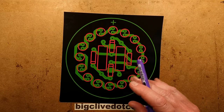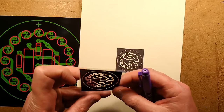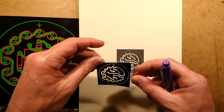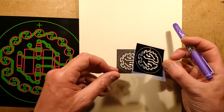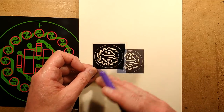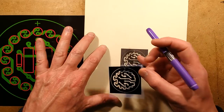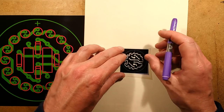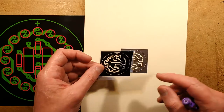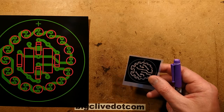When I'd designed it, I printed it off onto a sheet of paper and then set the printed circuit board design package — you can control the printer from that — to a very, very dense black ink, basically printing it as a photo with a very high ink output, with all the colour settings rammed up to max. So it produced a jet black image with very good contrast. I printed this image out, then taped a bit of the transparency material on to avoid wasting a whole sheet, and fed it through the printer again so it printed only on that piece of material.